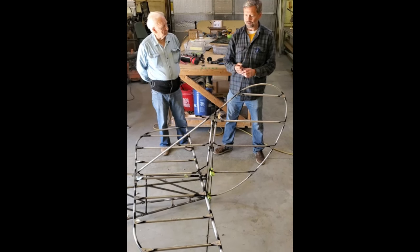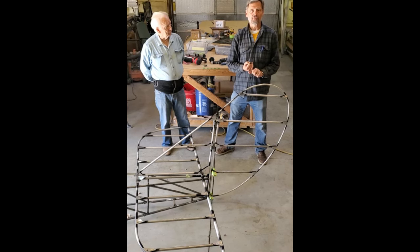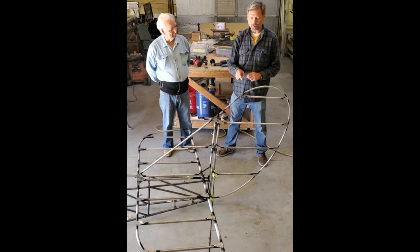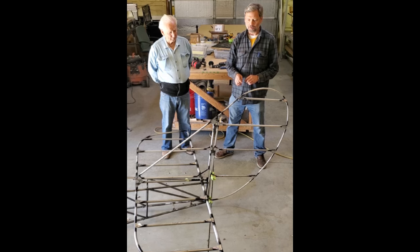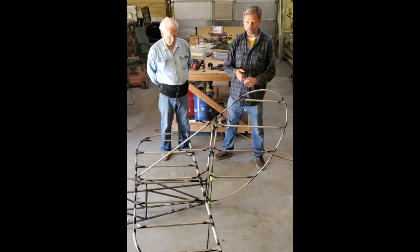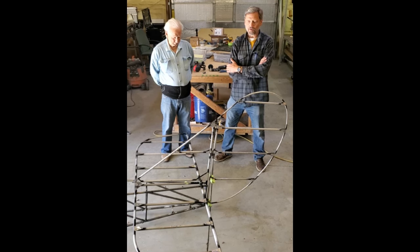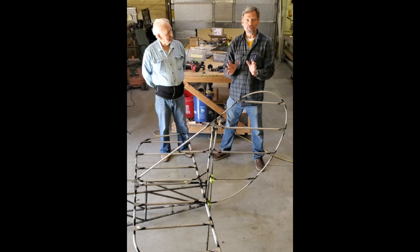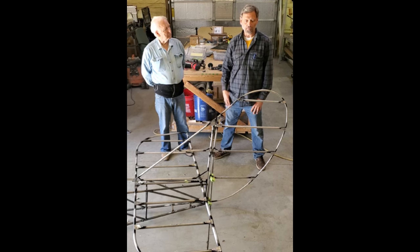I still definitely need assistance, but simple things like I've drilled holes in things all my life at home working on projects or working on a project for the car. But drilling holes in aluminum is a little different than drilling holes in steel. And so I learned all these various nuances about drilling holes and using different equipment, drill stops and things to protect the hole, that are sort of aviation specific construction techniques that I now know that I wouldn't have known 2 days ago, and I'm sure I'm going to learn a lot more.